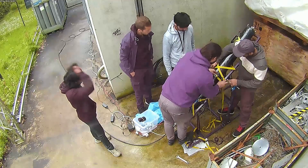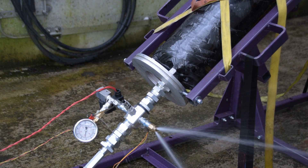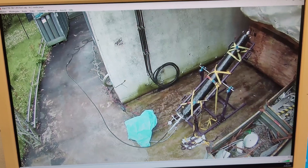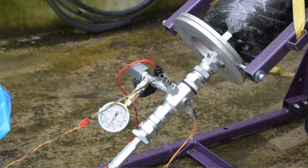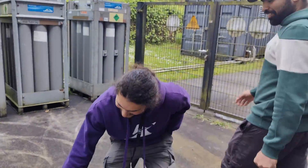Once that seam on the inside of the aluminum liner is broken, water basically finds its way to the surface because carbon fiber isn't exactly water-tight. At that point we just had to hope the welding on the next two tanks was a little bit better. The steel tank was able to withstand 100 bar — the pressure washer reached its limits and turned off, so you can see the pressure declining slightly over time. That's just because the connectors used into the tank were somewhat leaky, but that's a full success: the steel tank works!